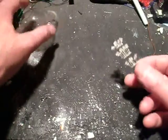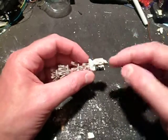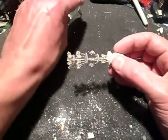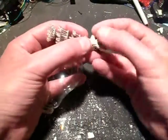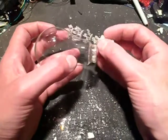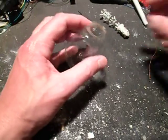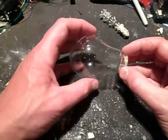Getting on to the power supply — this lamp is designed for European voltage, 230 volts, and inside is a capacitive dropper. The whole base was potted in white resin, which makes it a bit hard to take to bits. It was potted in a circular format, and then a rubber sealing ring was put around it. When it was put into the lamp, the rubber sealing ring held it in position, and they obviously then just drizzled glue around that to hold it, letting it cure before gluing it into the Edison screw base.